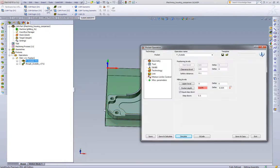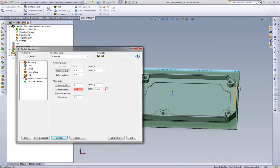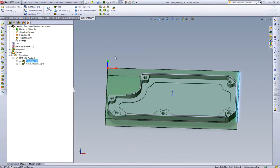To give you an idea of the size of the part, it is roughly 12.5 inches by 6 inches long. Now let's take a look at what happens if we use those exact same feeds and speeds — the 763 rpm and 12.5 inches per minute — with an iMachining toolpath.